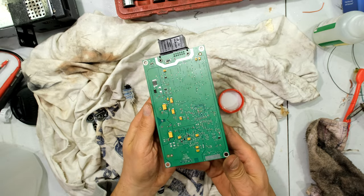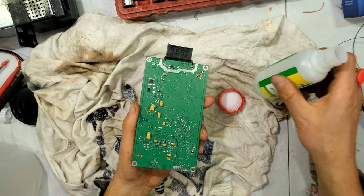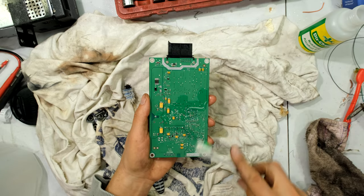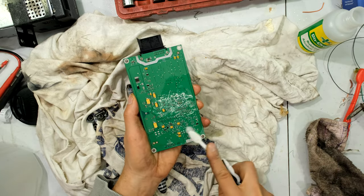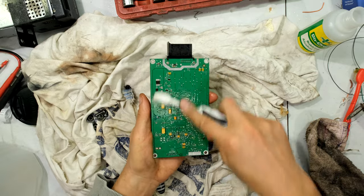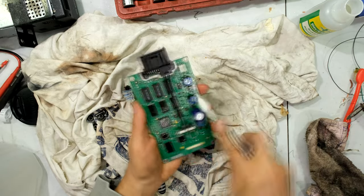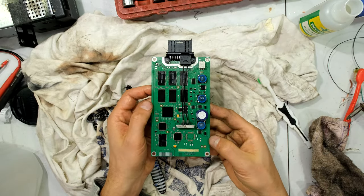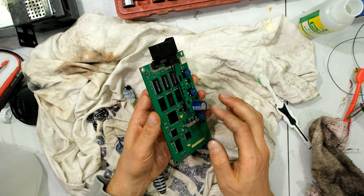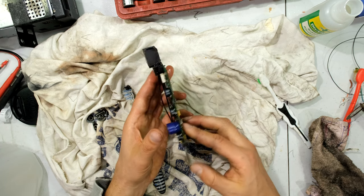You can take a blow just to dry it. Most of the oil is actually gone — if you look at this side, it's got a bit of a dirty residue, but that's where the alcohol comes in handy. I just put a little bit of alcohol on and do a final clean. The alcohol removes any oily residue that might still be there. Now all I do is leave this in the sun for a couple of hours — there might be some liquid that's gone underneath some of these microcontrollers.